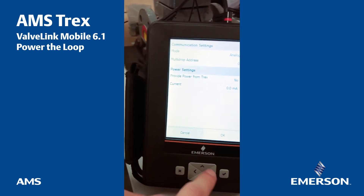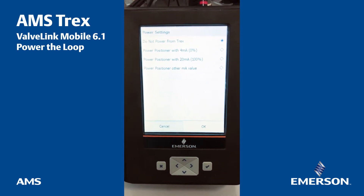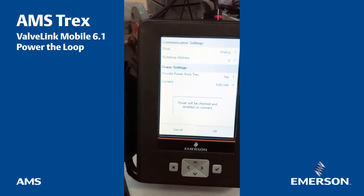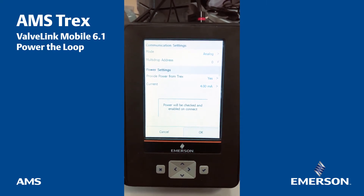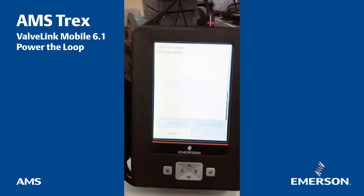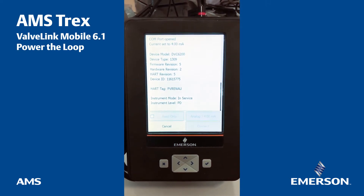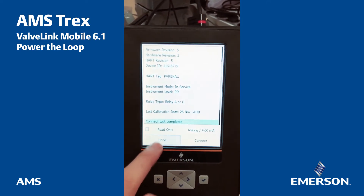Provide — yes. I need to wait. So here I need to select the first position where I want to put my valve and with which current. The one I'm going to select is 4 milliamps — this is where I want the valve to start. Now I click on the button Connect. It's connected to the device, recognizes the device, gives the name, applies some power supply, and everything goes fine. That's the first step.